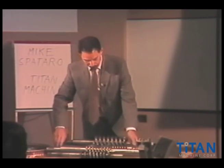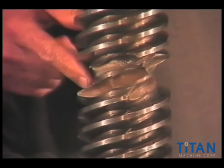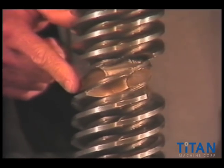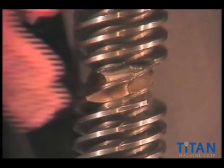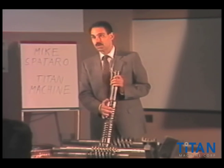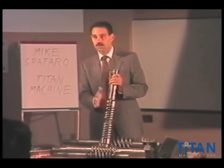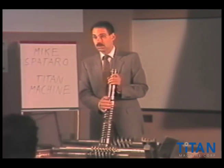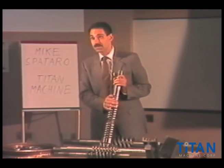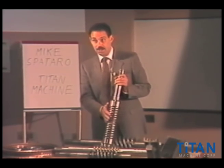But lo and behold, down below, those gear teeth are broken off. The worm teeth are broken off. Again, it's the exception, not the rule, but we're seeing this more often in this industry. As we downsize parts and ask equipment to do more work — sometimes these things go 450 feet per minute — this situation can happen, and does happen.